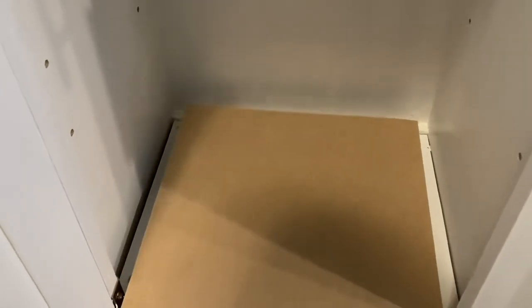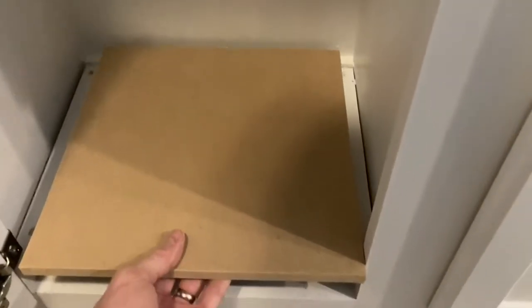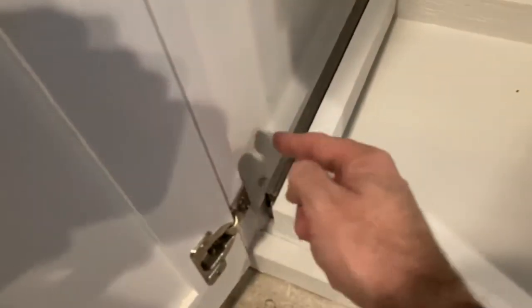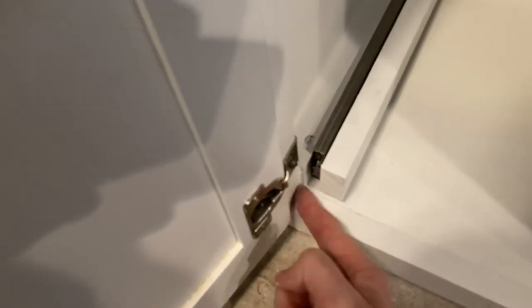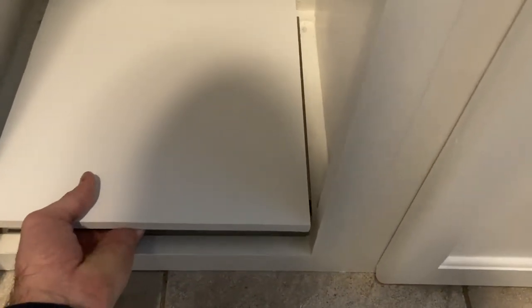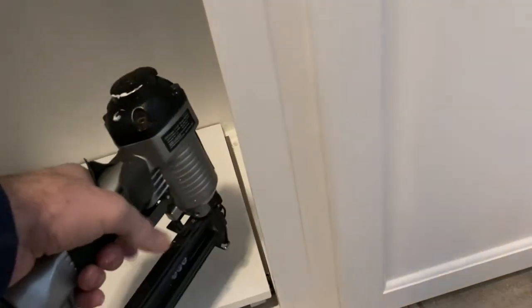Now I'll take a piece of wood for my shelf. There's room to the right and left, but I can't build out further because it'll hit the lip of the cabinet as it comes out — and that's okay. I'm going to caulk up the gaps we made earlier with some paintable caulking, run a finger along it to smooth it out. Once that dries you can paint over it. I want to see only white and stainless steel. I'll paint the shelf of course, and once dried I'll put it on. Measure the shelf well — depth and width — to ensure clearance for the door to close. Then use a brad nail gun to nail it to the bottom of those one-by-two mounts.